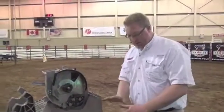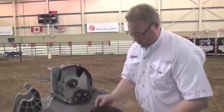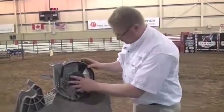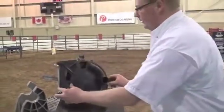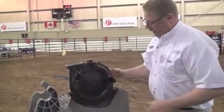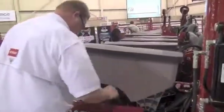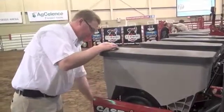With all that done, everything's clean — you've removed all your seed treatment residue and cleaned everything out — you're ready to put things away for the winter. For your seed discs, store them separately somewhere flat, dry, and clean, numbered and marked, ready for spring. Your agitators can go back on — they only go on one way, which makes it easy — then put your cover back on. With that done, you're free to put your meter unit back on your row unit and you're ready for winter storage.